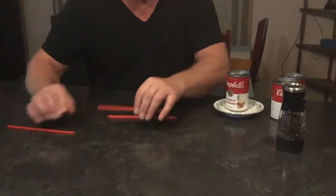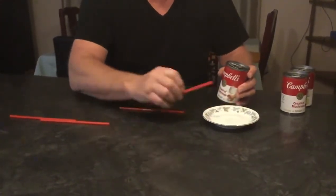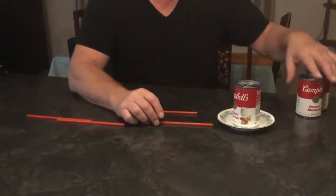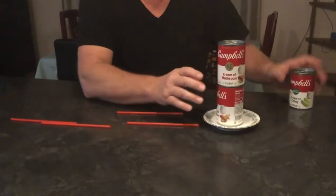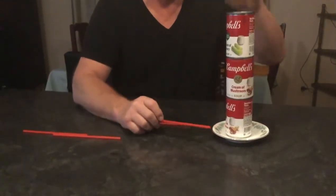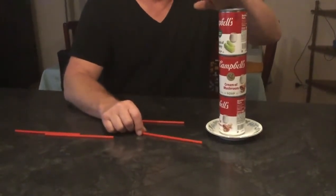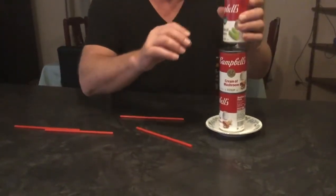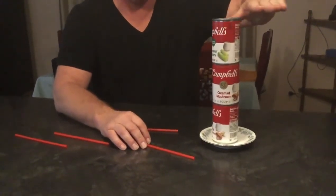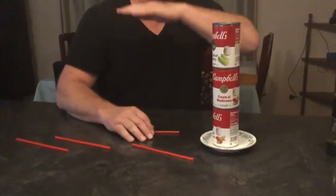You're laying pipe and you think it's perfect, but then you get to where you've got to put the base. You do the math, countersink the base down, pipe goes on, and then the manhole. You might think that's all perfect, but the problem is it doesn't really matter where the pipe was — you have to have taken into account the base, bottom section, middle section, cone casting, and everything, because you've got to match the street level. The pipe itself has some wiggle room; you can fix it later with a different grade. But the casting has to be perfect because it sets with the street. If it's not perfect, you'd have to replace sections or get smaller sections, and they'll catch you for being too low or too high. So you must use the above-ground laser to confirm everything below is at the perfect depth so that when they pave the street, it all matches.